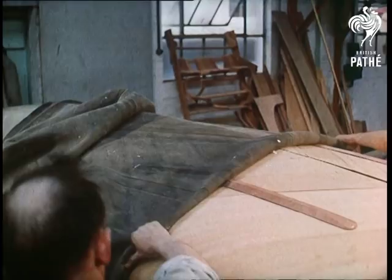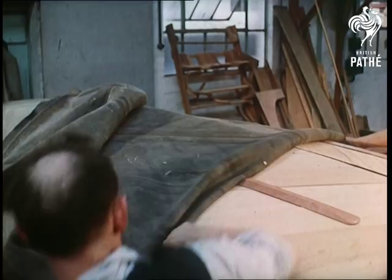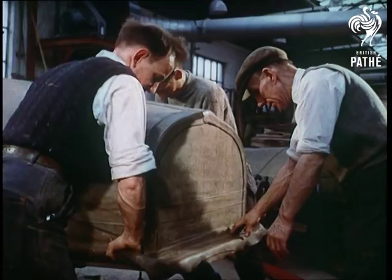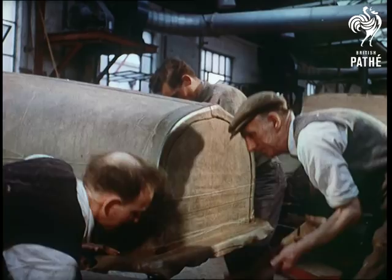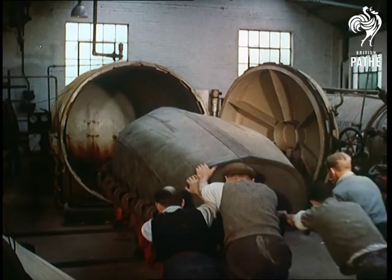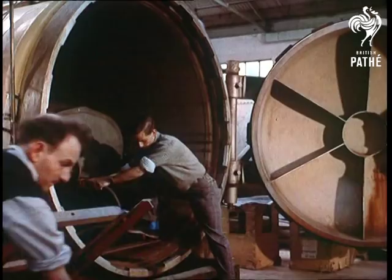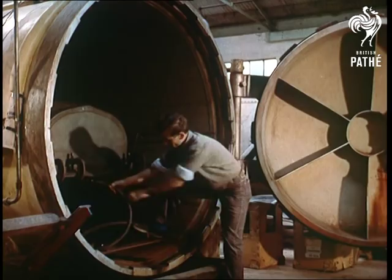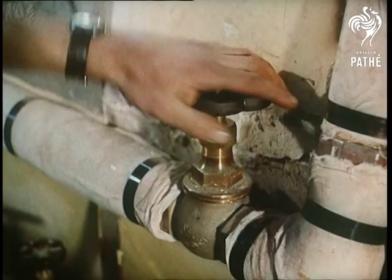To make the shell even lighter and stronger, it is then baked in a special oven — a unique method that was developed during the war in aircraft manufacture. To do this, first a rubber bag is fitted over the mould, clamped down and a vacuum applied until it's stretched skin-tight over every square inch of the hull surface. The whole unit is wheeled into the oven, where steam heat of up to 100 degrees centigrade is applied for approximately half an hour. During this heat and pressure period, the synthetic resins used in gluing impregnate the wood cells to make the hull extremely resistant to water and, important in the tropics, to heat and termites.